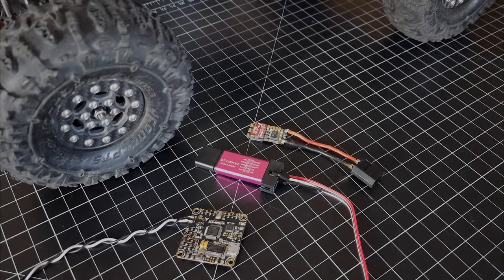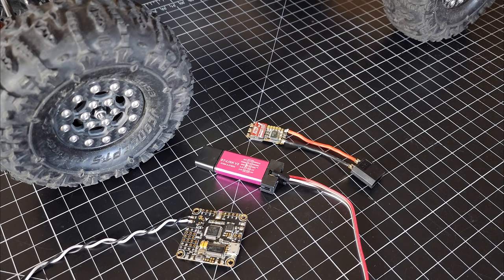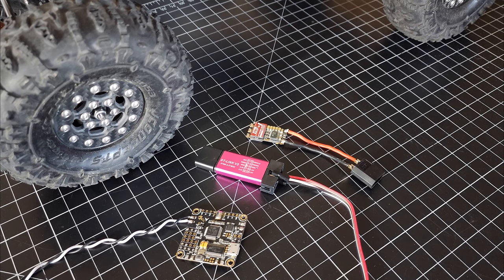Alright, what's up guys. If you watched my previous video, you'll see that I put a drone ESC in my CCv1 crawler. I was crawling on the stock BL Heli firmware and it worked okay, but it didn't have that RPM lock field orientation control — whatever that comes on like the Crawl Master Mini and the Hobbywing Fusion.